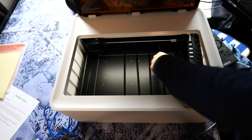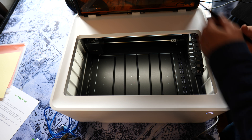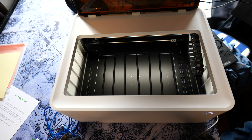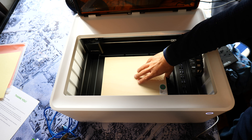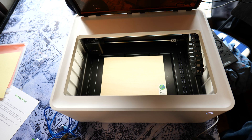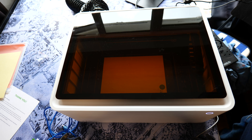Let's talk about the design. Looking much like a big inkjet printer or combo scanner thing, the X-Tool M1 is a prosumer-level tool that will look right at home on any desktop or home environment. It's quite bulky though, at roughly 56cm wide by 45cm deep and 23cm tall — or 22x18x9 inches — and it weighs just under 10kg, with a laser-blocking transparent brown acrylic top. The working area inside is 30cm deep, 42.7cm wide, and 12cm high, which is very reasonable. It can easily fit an A4 or standard square size of heat transfer vinyl sheet.